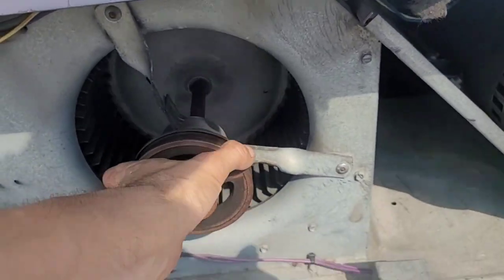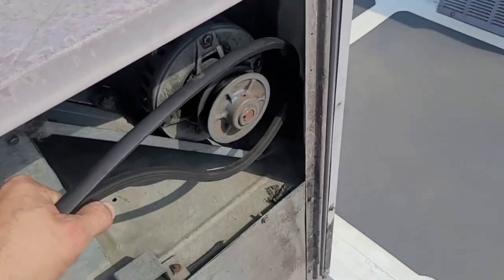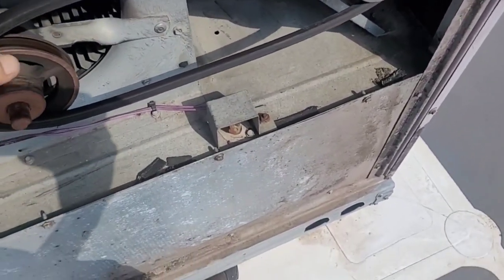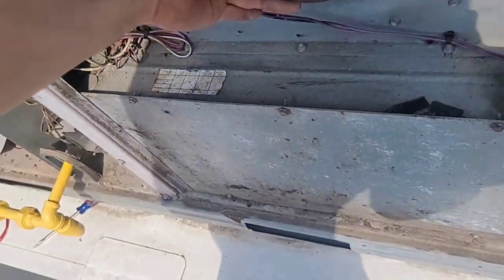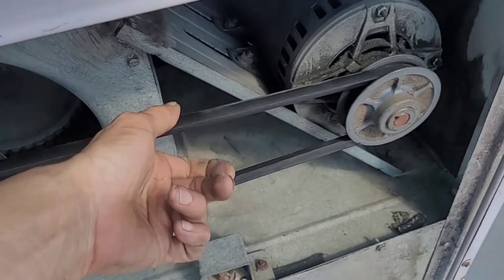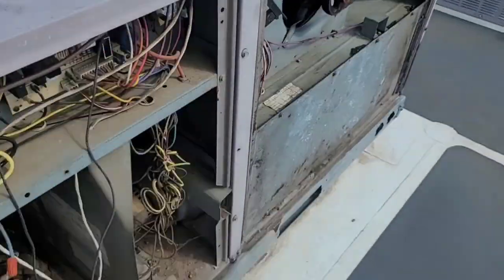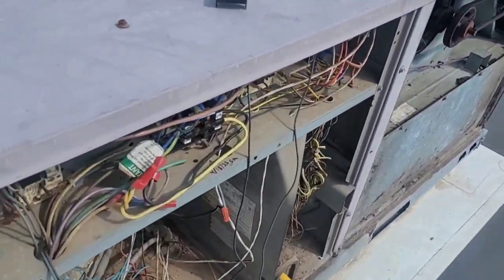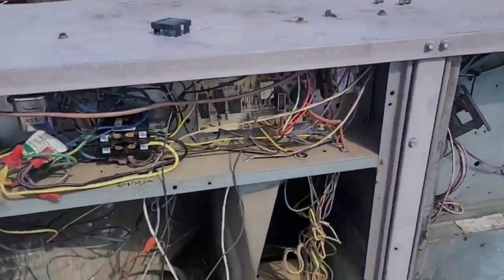This turns good — there's nothing wrong with that as far as this thing goes. It's not too tight. That thing's just weak. So I'm going to verify voltage and make sure I've got good voltage going to it.